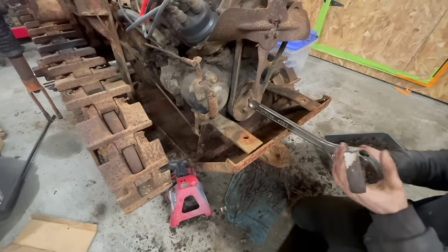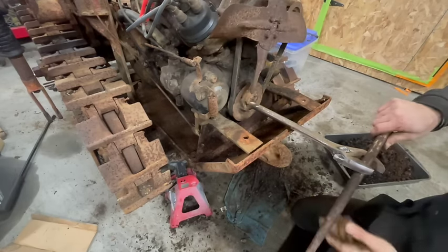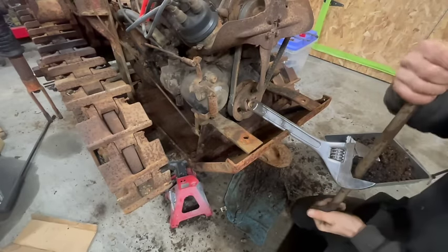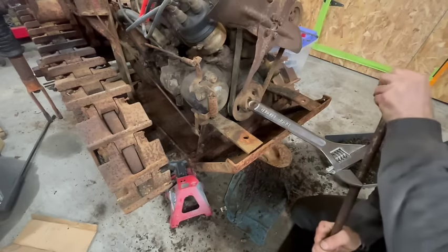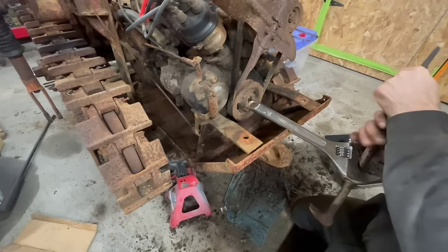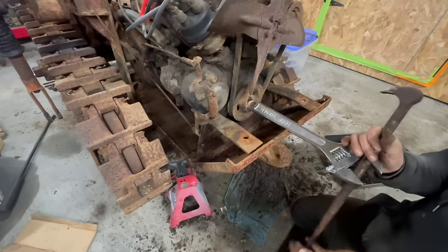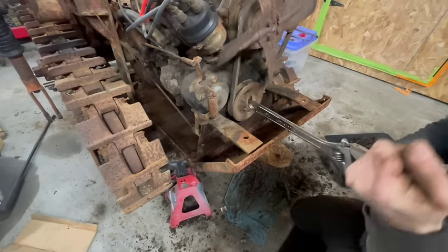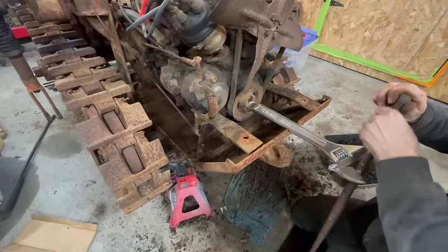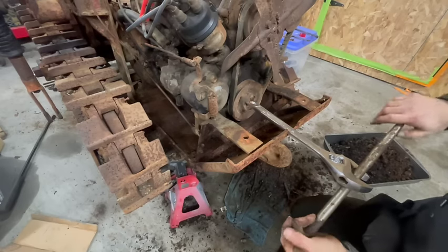Some tools here. Well, this is really good news. I thought it had a stuck valve, but apparently not. You can hear the oil gurgling in the cylinders. My best guess is that all of the valves that have gone up are now stuck up. The squealing noise you hear is the generator, not super thrilled about turning. I think we'll give it a new belt.